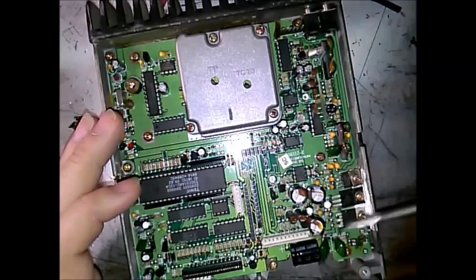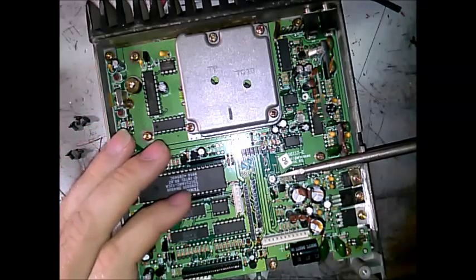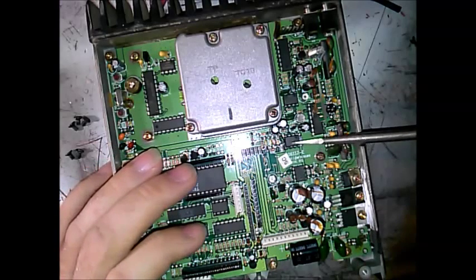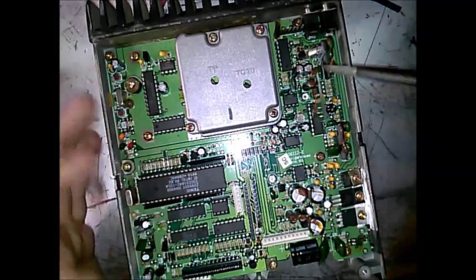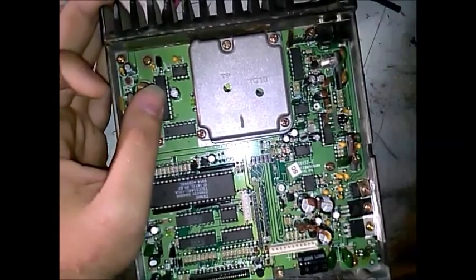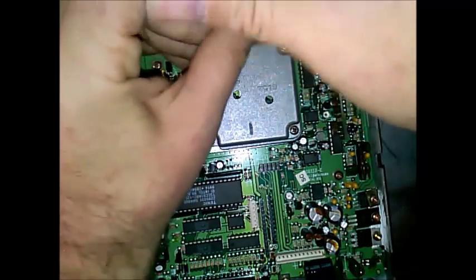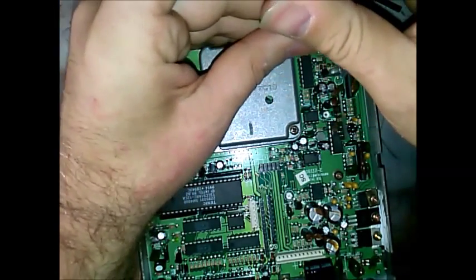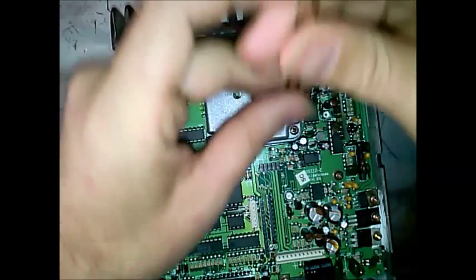This is your audio circuitry, mostly right here. We have the DCS and CTCSS modulation controls here — this has the op-amps and DCS encoders. This is all part of the audio, and it also connects with the PL and DPL encoder.